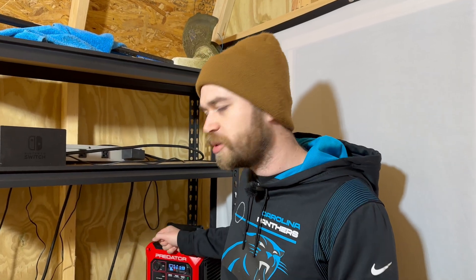This might be controversial advice, but if you're wondering how many watts something is going to use, ChatGPT is a really good tool to give you a good estimate. You can just ask it how many watts something is going to use — for example, if you're looking at a 5000 BTU AC window unit, you can ask ChatGPT how many watts that's going to use and it'll tell you around 500, so you'll know this 350 watt power station isn't enough for that. You can also ask it how long things are going to run — say you have a 20 watt box fan, you can tell ChatGPT you've got a 350 watt power station with 294 watt hours of capacity and ask how long it'll run, and it'll tell you. I use ChatGPT for that all the time.